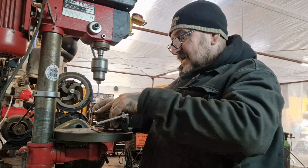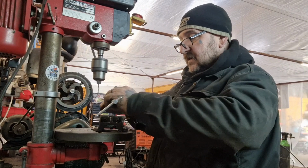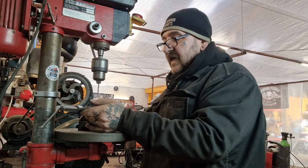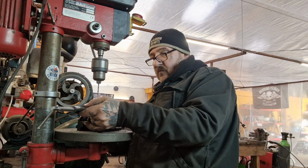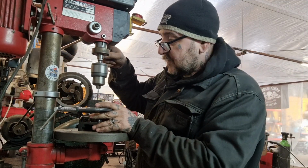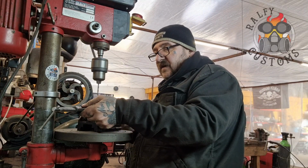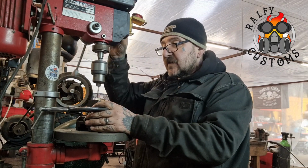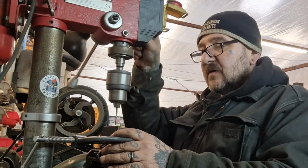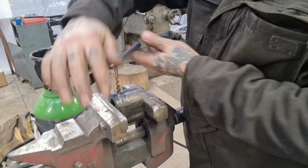Once we've, oh, sorry, I'm undoing the wrong thing, look. Once we've separated these and tapped them out, so I'll get this one done. And then just do the same with a bigger drill bit, a 6.8mm drill bit, for the M8 adjuster, for the wheel adjuster. So, happy days. Now we can tap these out.